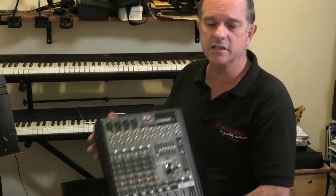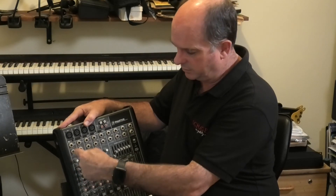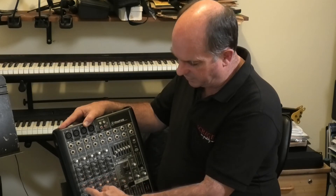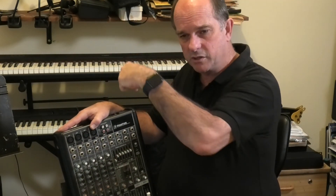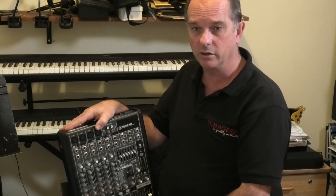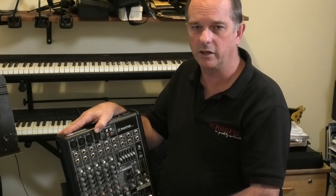That's really simple — you can get a PA system running really fast. This is a tool, not your performance: get it up, get it running, get on with what you really want to do, which is play your instrument and make a good sound. Follow the sound source: microphone, cable, in — allow that in, fix the sound so it's good quality, and send it out. If it's not working, problem-solve along the chain. Too many times I've seen people rush off and change the microphone when it still doesn't work — because some idiot hit the break button when you weren't looking. Really just think your way through it. It's simple, it's logical. You can do it. Catch you around at the next performance.